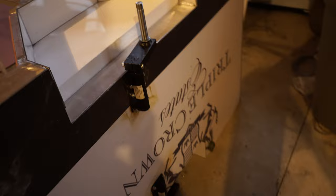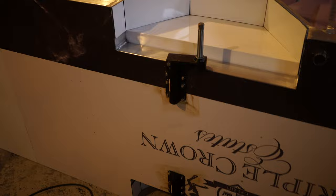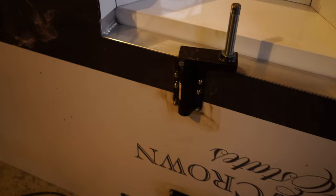Here's a closer look at the torsion axles by FlexiRide. I had Branson Machine take these spindles down — I think they were about an inch and a quarter. I took them down to 20 millimeters to fit a bicycle through-axle standard. Using stainless steel locking washers and locking nuts. On the bottom I've just left the old sign on there. The actual sticker on the ACP will probably prevent any galvanic corrosion as it is, but I had the spray so I sprayed it on there.